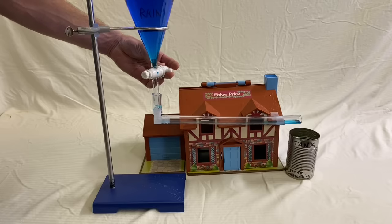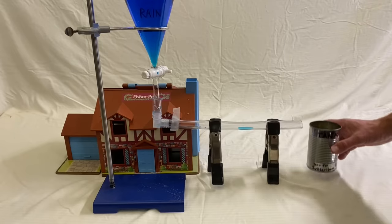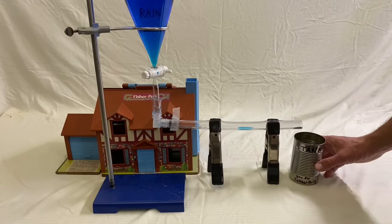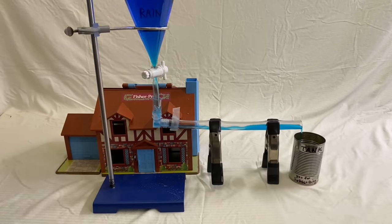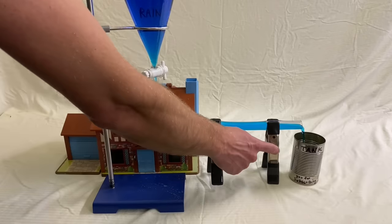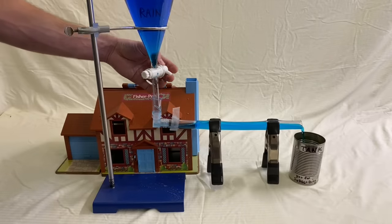Another way is for you to build something like a ramp for the water to flow down, often called an aqueduct. This allows you to put the tank further away from your house and still use gravity to fill the tank. The downside of the aqueduct setup, though, is that you have to build a large, somewhat complicated structure above ground. The aqueduct structure also takes up usable yard space.